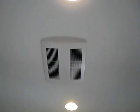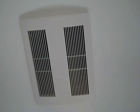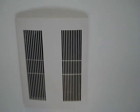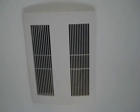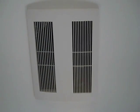We've got two very distinct fans in here by Panasonic, which is really my favorite bath fan manufacturer. That one in the ceiling — kind of a large box — is actually a fan-heater combo by Panasonic. They've redesigned them recently; they're a little sleeker and more contemporary looking. Let me turn that on — see if you can hear it. Not much noise at all. That's probably somewhere around 1 to 1.2 sones — that's the exhaust fan going.